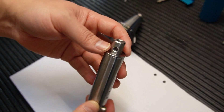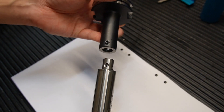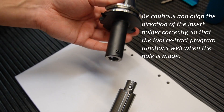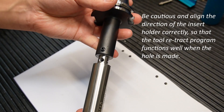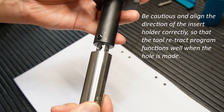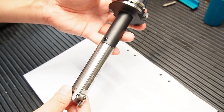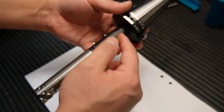On the back of the body, you have the connection mechanism which you use to couple to the master shanks. In this case, it's a CKB interface. You have different types of master shanks, and you want to make sure that the total — the overhang ratio from the flange surface up to the insert — doesn't exceed the working length defined in the catalog. In this case, it's seven times the diameter.